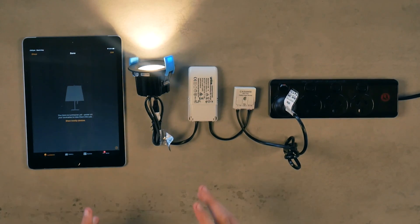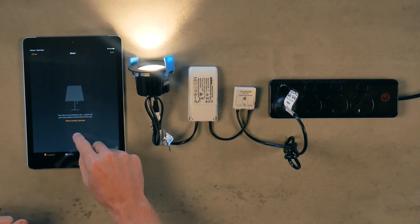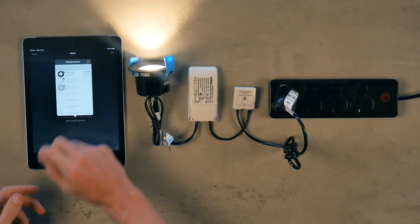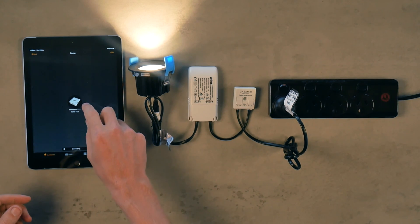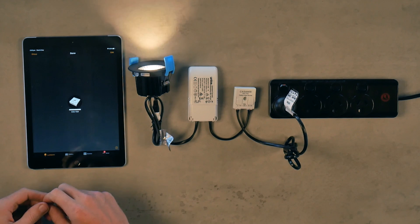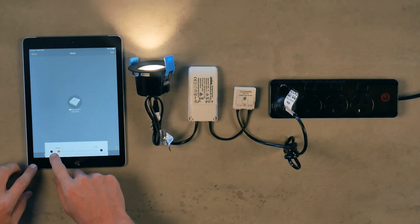I've set up a basic network and now we're going to set up a module to show you how to switch on and off and up and down. So I have my demo network here, we click on show nearby devices, select our module, add it to the demo network — a luminaire has appeared. Now we can turn it off, we'll turn it back on, and then we hold the icon and we can change the dim settings.